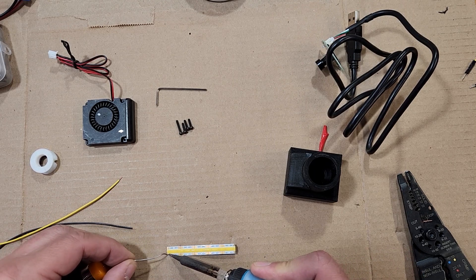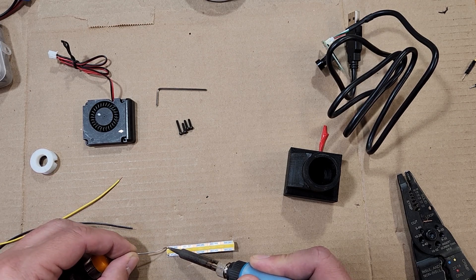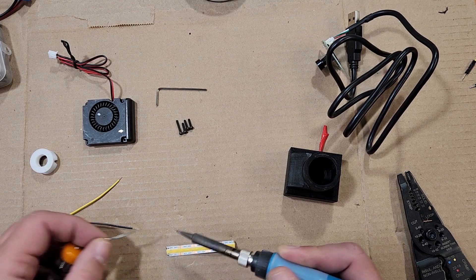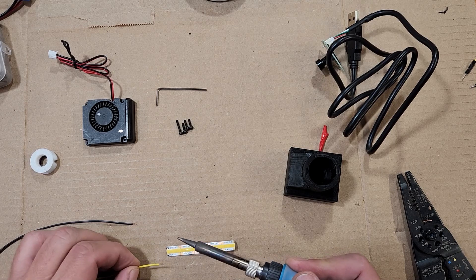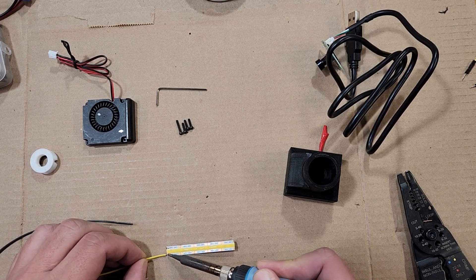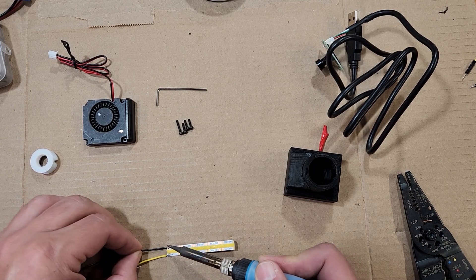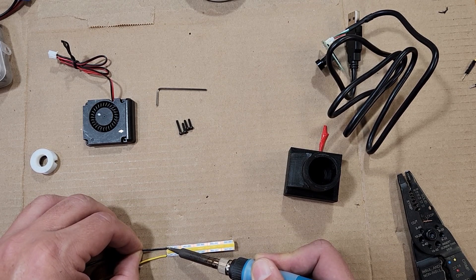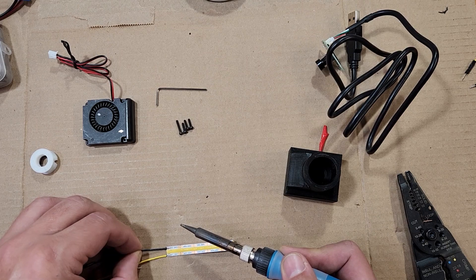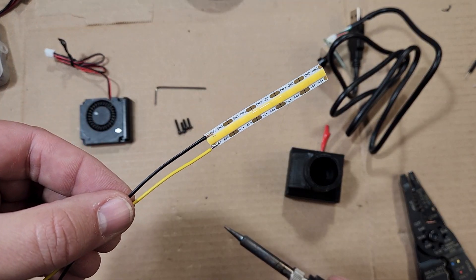At this point I'm going to put a little bit of solder on both the positive and negative leads. I put my iron down on the lead and just make a drop of solder — this will make it easier to solder the wires on. I just put the wire over the ball of solder and heat it up, let it sink in. We do that for both sides. Once we're done we want to double check to make sure those are good solder points — we don't want them coming off when we wrap this around the light ring.